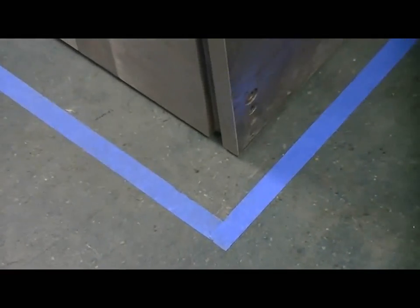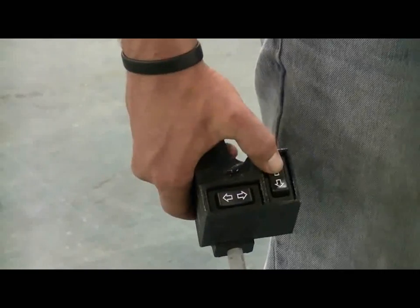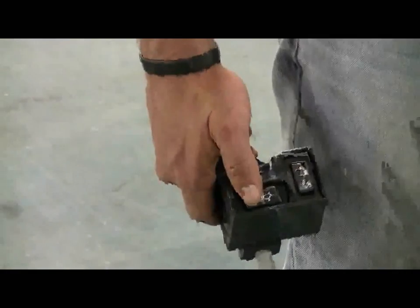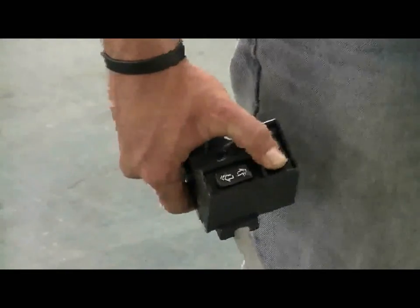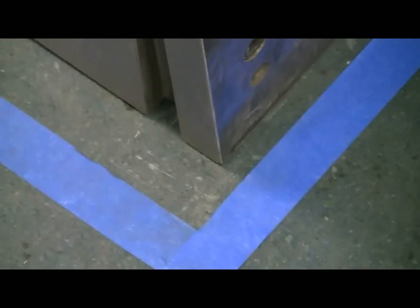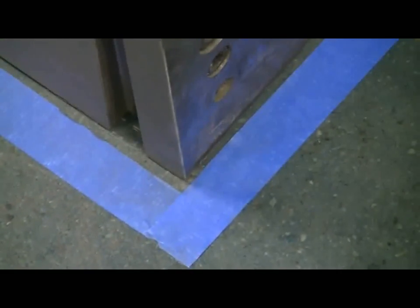With our mold now in close proximity to the target we've created, the Fork Crane Precision Control Unit now makes it easy and quick to precisely place this tool in its proper position. With spring-loaded, rocker-style switches used in the handheld controller, the operator controls not only the directional movement, but the delivery speed of the object being guided and lowered into place.